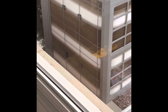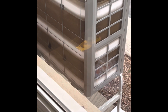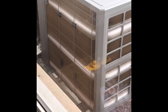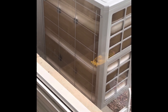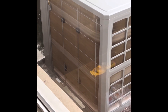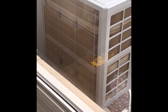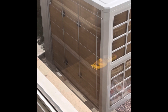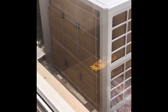I just wanted to let you know — as I wasn't aware of this before I got it — that it was going to be icing over depending on the conditions outside. As you can see here, it's melting fairly quickly, and after that you're going to see it start to drip underneath. There's actually a coil on the bottom pan of the unit to make sure ice doesn't build up and frost over. There's a sensor — you can see it on the top left — that actually sensed this frost in the first place.